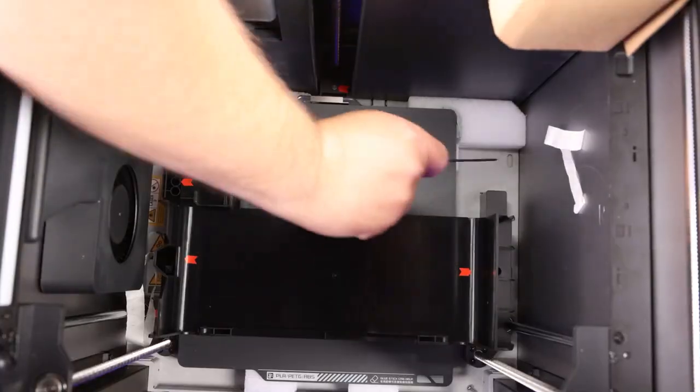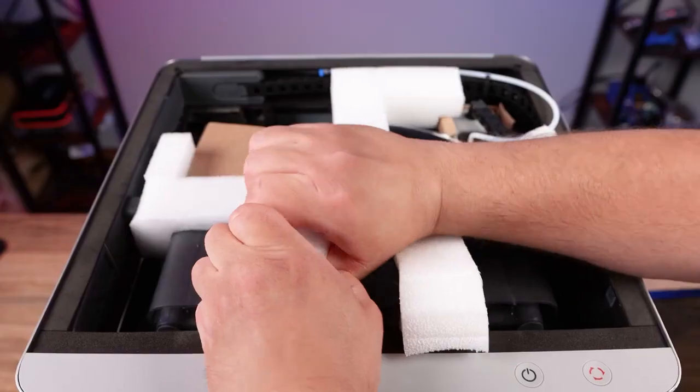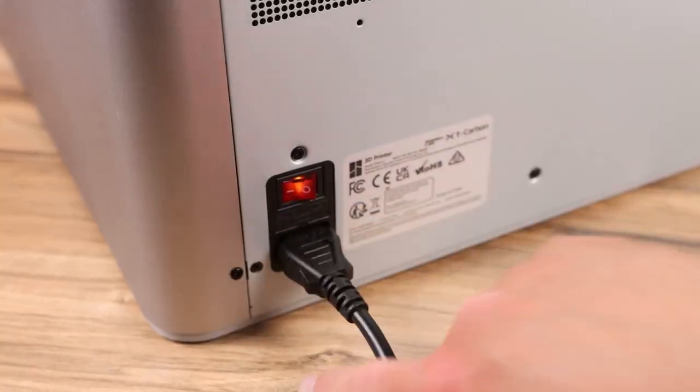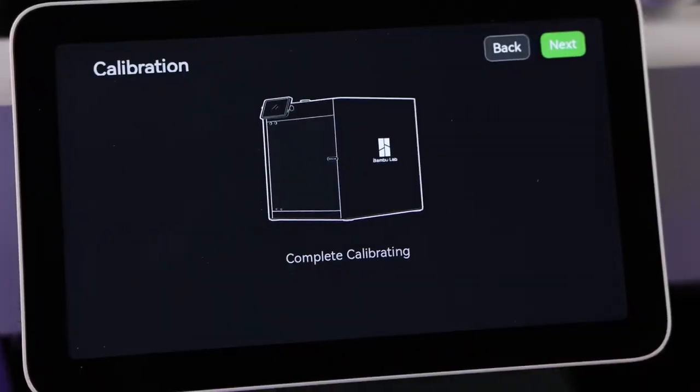Next, you'll need to set up and install your 3D printer. You usually do that by following the manufacturer's manual that came with your 3D printer, and that walks you through the assembly, the software or slicer setup, and configuring your 3D printer for the very first print. Most 3D printers these days are mostly built, and they would take you roughly around 30 minutes to get fully set up. There are some kits out there that could take you much longer, and there are some that come fully assembled that take you much shorter, but I would definitely plan roughly around an hour average to get yourself set up with your brand new 3D printer.